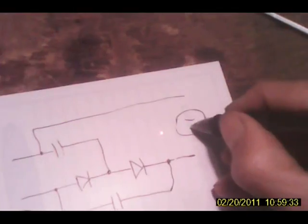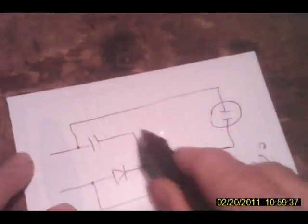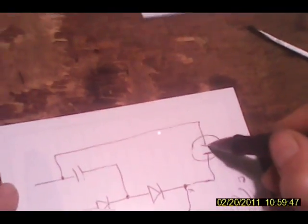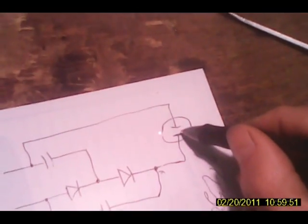That is just absolutely gorgeous. Okay, that'll do. All right, we have our little voltage multiplier. This is a very simple circuit. This gives us a voltage of 2 times right here, and then we add the peak voltage of this on top of it, so we get a total peak voltage here of 3 times as much as the line voltage. So it's over 400 volts that we get on the tube.